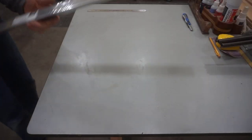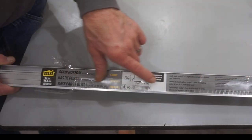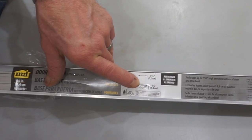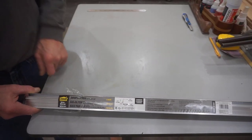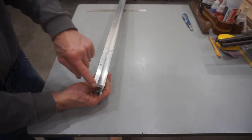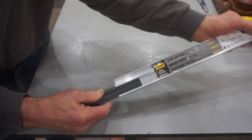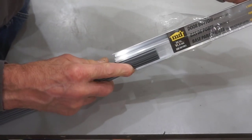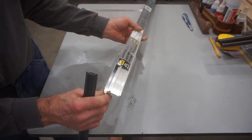So I did some shopping around and came up with this door bottom by MD because its spec shows that it's a half inch tall and should do a fair job of sealing up the gap at the bottom of the door. The only trouble is I don't like this profile because I don't want any metal showing on the face of the door, but I do like the look and fit of the seal part placed in the track, so I'm going to do a little bit of modification to get the best of both worlds.